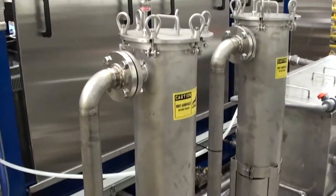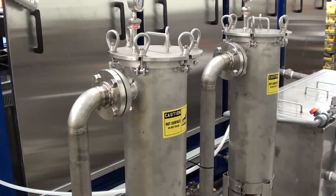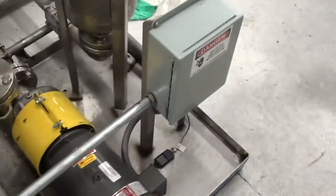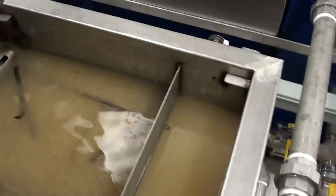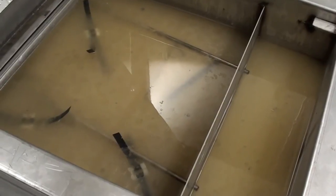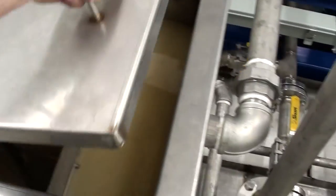All tanks have 30-inch, 8x30 filters with three horsepower pumps on the two rinse tanks and a five horsepower pump on the wash tank. The oil coalescer is run by a one-and-a-half horsepower pump that recirculates with a sparger and coalesces any oil from the wash tank to ensure clean chemistry returns to the tank at all times.